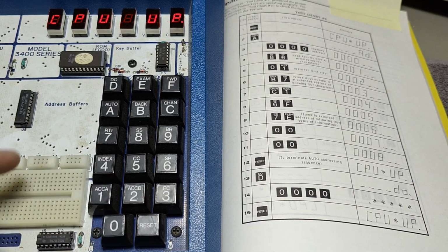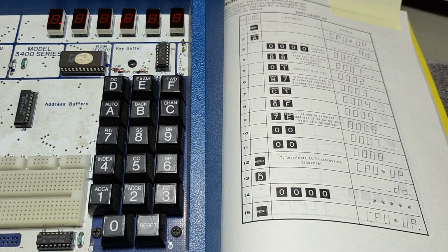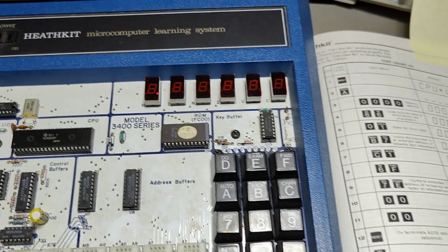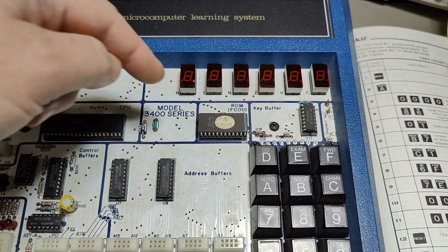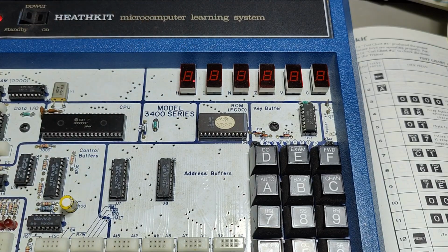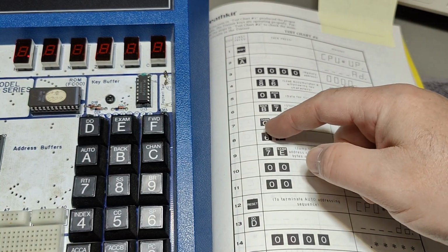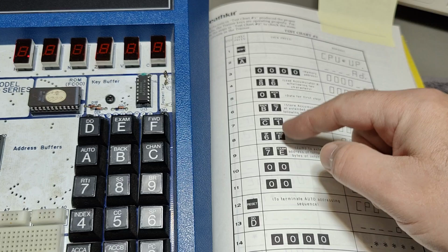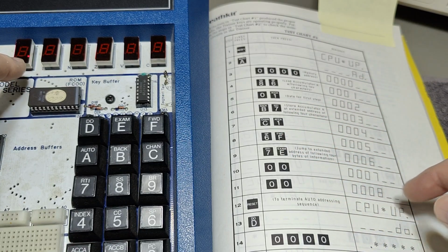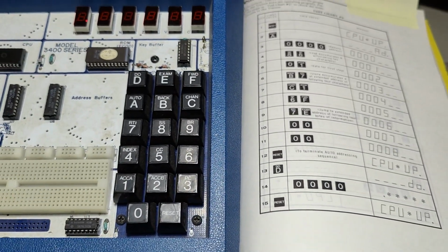Now let's try and run it with this do, and then we put in 0, 0, 0, 0, and then it runs the program. Now it looks like the program is not doing very much, right? But what you will notice is this little decimal point here is lit. And the fun thing is this display here is at that address in memory. So here is the address for that first digit, and the 01 data that we are writing to that address is driving that LED, and that is proving that this program we just input is doing exactly what we want. Aren't you fascinated?